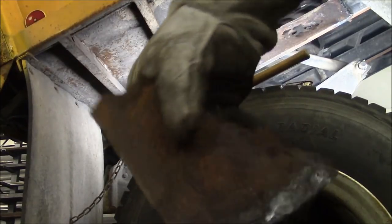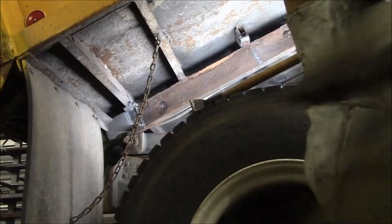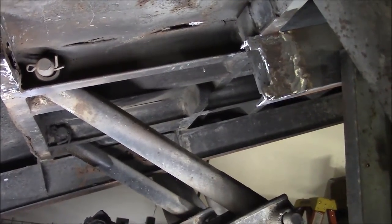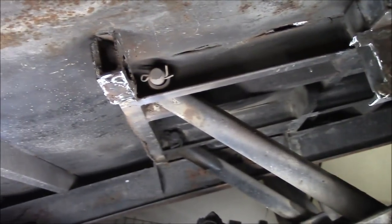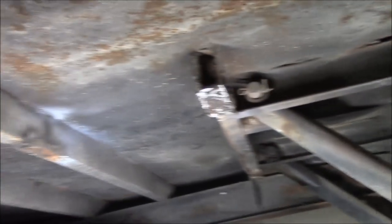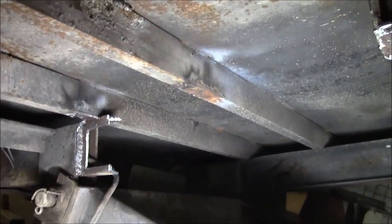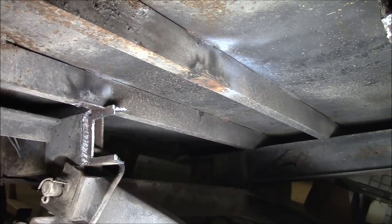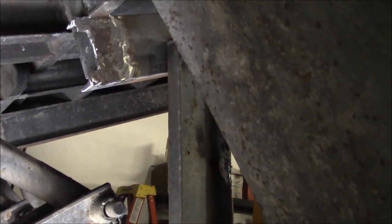Check it out — that's a big old solid chunk of rust. Pretty crazy. Everything is cut out and cleaned up. I'm going to try having these notches here to see if that makes for a little bit stronger weld. I've got a patch — this piece of channel iron right here — it's a little rusty, and by a little bit I mean I can put my hand through it. There's an even deeper notch back here. I'm going to grab some lunch and then cut out the new pieces and get her welded in — I'll do one whole side complete then do the other side. I welded a piece of the old channel iron in there as a brace just to keep the box from springing around on me, and I've got two pieces of wood under the front plus a steel prop on the other side.